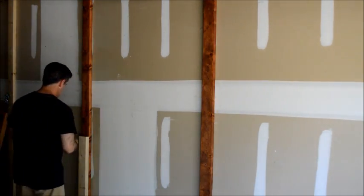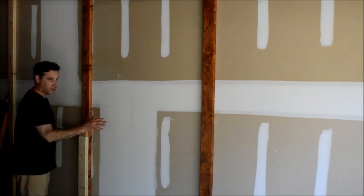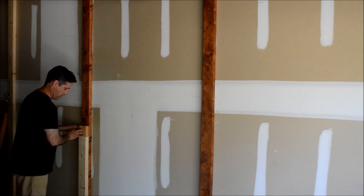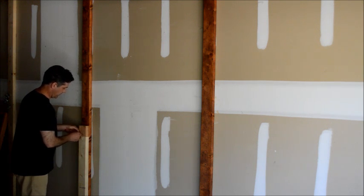As I made the cuts — the small cuts from the larger piece of 2x4 — in each one I've placed a couple of holes. The purpose of this is to create basically the brackets for the heights we want each of the crossbeams to be at. To help with that, I've created a story stick — a rod of a specific length — that we'll use for each one of the posts, so that each bar is perfectly leveled on the floor.